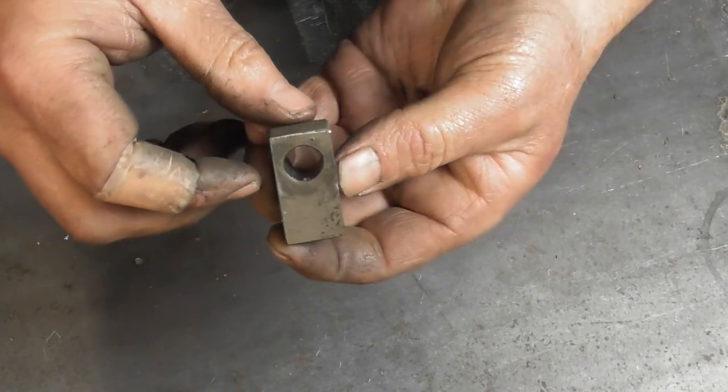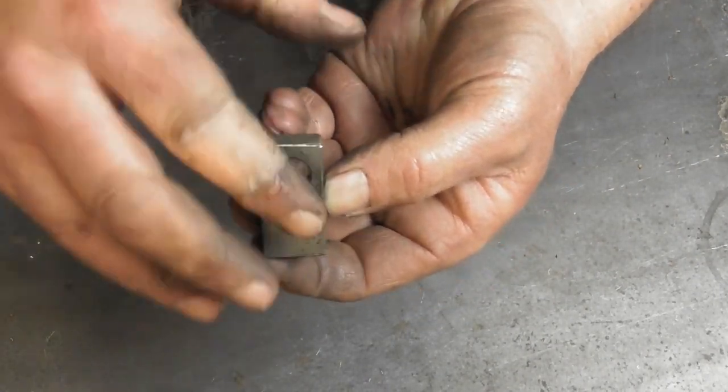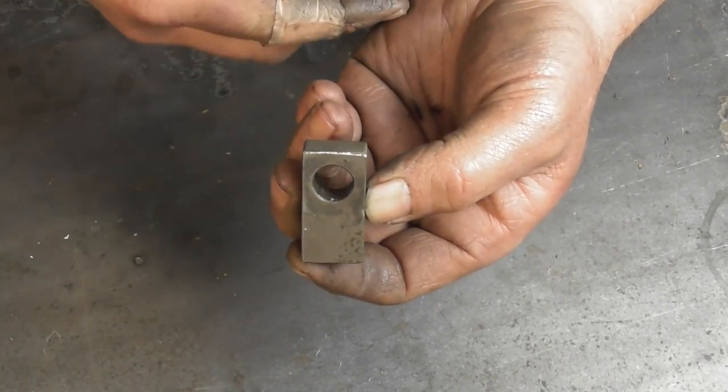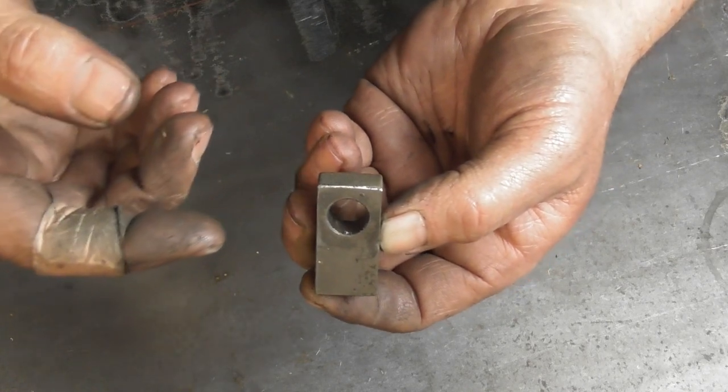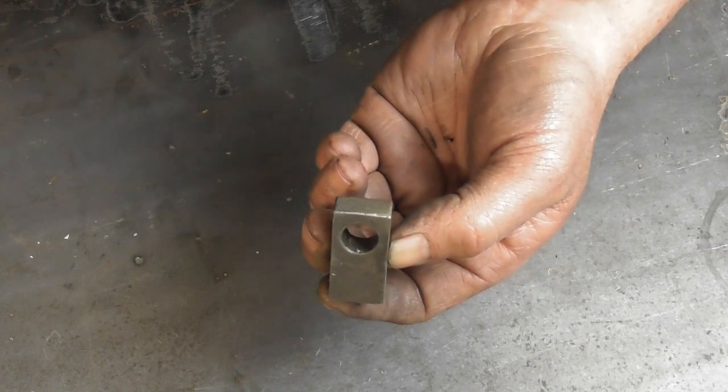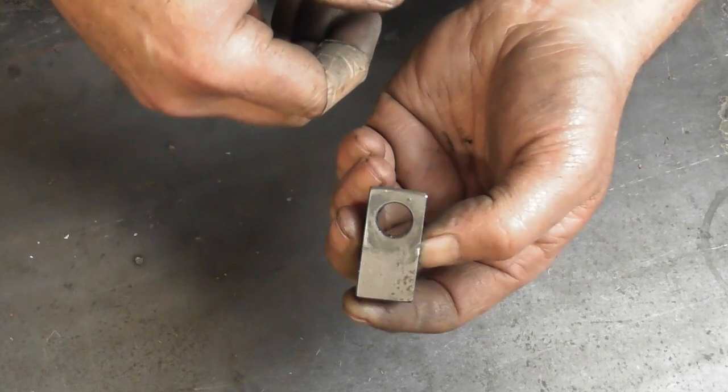So, my way of thinking is, if I take a mil and a half off there, that'll give me clearance on the pin to be able to put a washer to the other side of it. And then allow me to get the circlip on the back. That should, in theory, take the bar away from the pulley. Let's have a go.